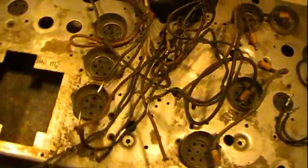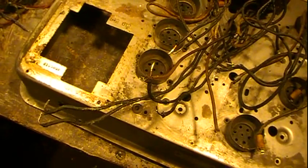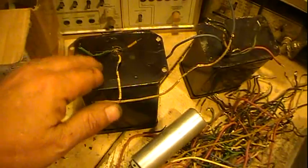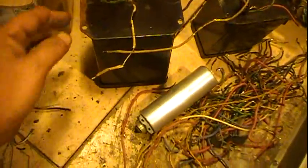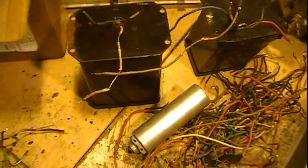The transformer — I had tested it at least under no load, and it worked just fine. The rest of this is just basically digging into stuff and cleaning stuff. I'll let you know where we're at on this. And what I decide to do with it — I'll show you — this is the power choke, or choke in the power supply. It's actually on the 600-volt side — well actually 300 volts, there's the center tap. So I want to make sure that we don't end up with any shorts there. As well as the interstage audio transformer, the primary is carrying your B-plus voltage as well.